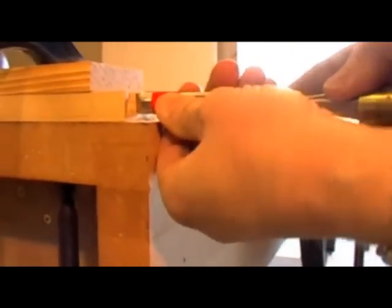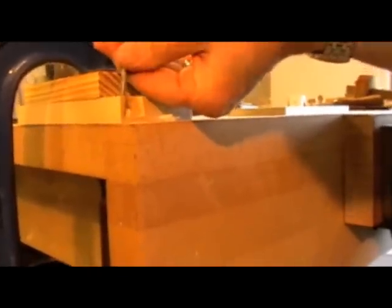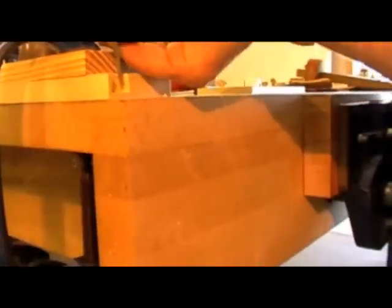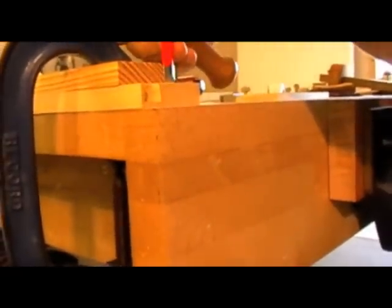You can buy a left and right handed dovetail chisel to get into here. I'm just using two chisels of a standard set — this one being an eighth of an inch or three millimeter chisel. This is where it starts getting a bit more fiddly, and getting these corners nice and clean is all important. That one's looking fairly good — I'll do the others the same and I'll have an overall look at them at the end.